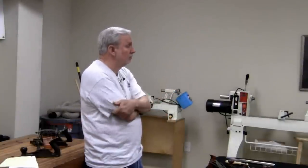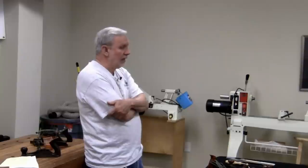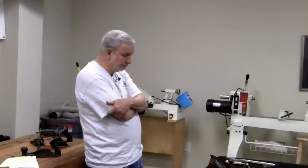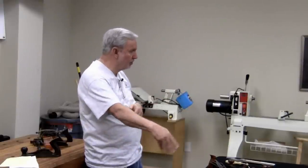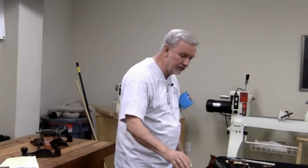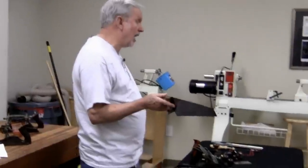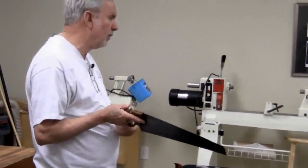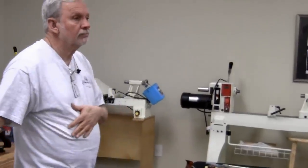Gentlemen? Yeah? If you had one of those hand saws and had some rust on it, what would be the best? Take some 4-0 steel wool and some WD-40. Scrub it with the grain. You'll see the direction. And don't try to take all of the patina off. If I had tried to turn this into a new saw, it would have ruined it totally. Not from a use standpoint, but from a collector standpoint. You can clean too much.